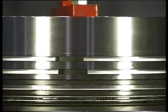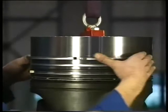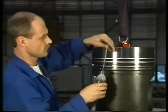Divide the gaps of the piston rings above the gudgeon pin at an angle of 180 degrees in relation to each other. Apply a proper layer of clean engine oil to the piston rings so that the piston can be mounted smoothly in the liner.